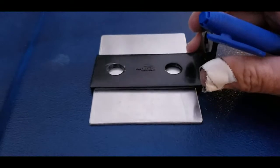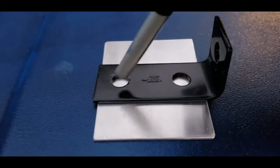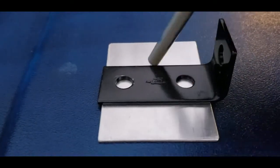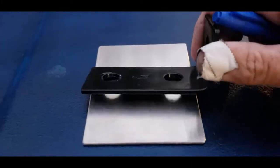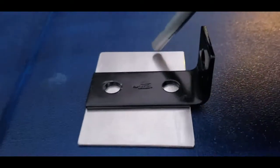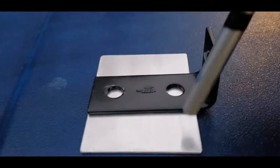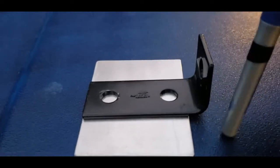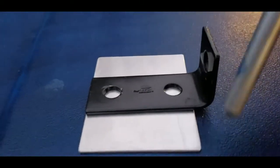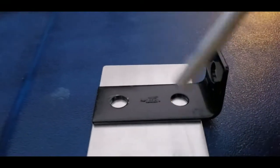and kind of use that as the big washer, so that even though this part is connected to the shell, I think this will give it a bit more security with the oomph and the wind. It's like having a big giant washer. So I'm going to drill a hole here and a hole there, and this is going to be my big fat giant washer underneath. This will be the shell, this will be the extra. I just think more space will make it more secure. I'm going to try to do that on all 4 spots on the first panel that's overhanging.